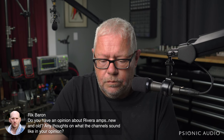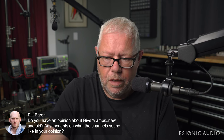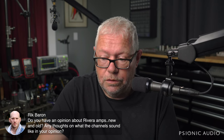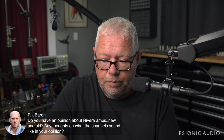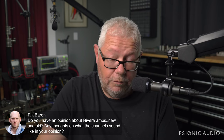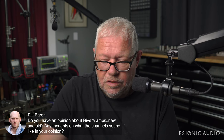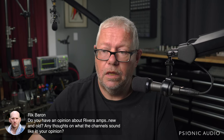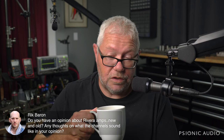So between that and some... I'm not a huge fan of the solid-state reverb circuits that some of them have in their tube models. I'm being honest, I'm trying to think of any reason to dissuade you. But other than that, they're built really well. I just think if you have a problem with a bad pot, you may not be able to get the amp 100% or at least retain the Rivera knobs because of D-shaft stuff. So there are some downsides, but odds are, if you find one you like the sound of, it's going to last. May need to be recapped eventually. They're well-designed amps, and Paul's a very creative guy. I just don't agree with all his voicing choices, but that's purely subjective.